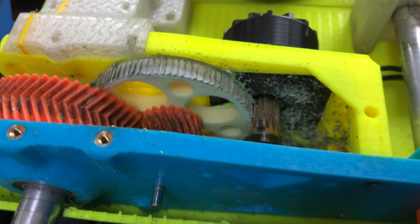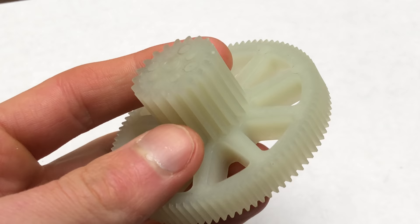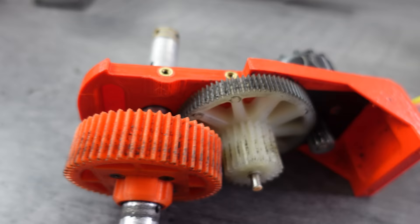After a few days of driving, the 3D printed PLA gears were actually holding up really well. Keep in mind this is just driving at a consistent speed — I think accelerating quickly would be what really does these 3D printed gears in. But I was surprised at how well they had done after several days. So after that I bought a mold for the glass-filled nylon gear — thanks to all those Kickstarter dollars. In the past I tried machining nylon and that didn't work out too well, but injection molded nylon is stronger.